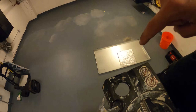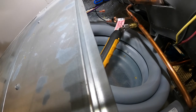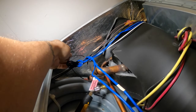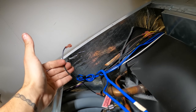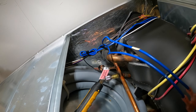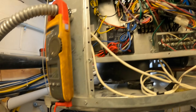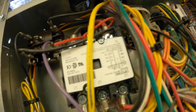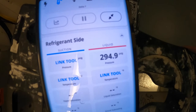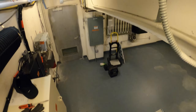I took off the condensate panel underneath so I could at least get my head in here. Where's the other pressure control? I see the wire right here. Unless this thing is hacked — look at this. That's the other side of that pressure control. Let me connect that real quick. I put the two wires back and reset it. Look at the plunger for the contactor — it's in. This unit started! Somebody was hacking this thing.